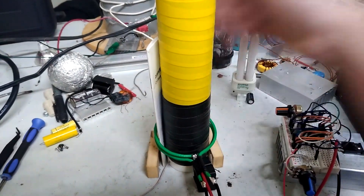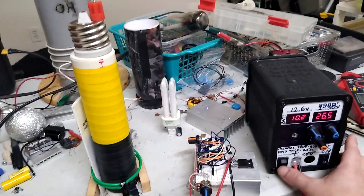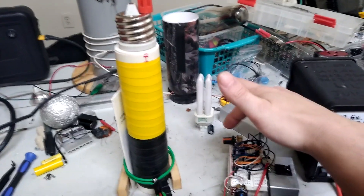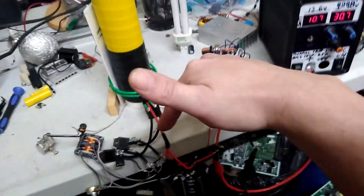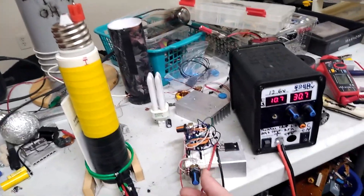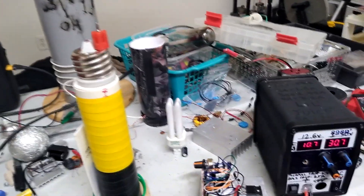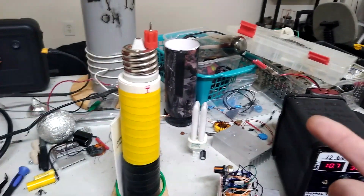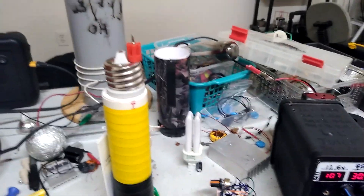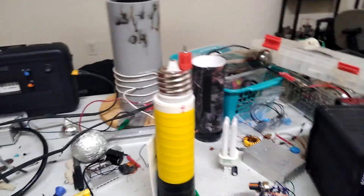Yep, and I got arcing — see the arcing down there, all the way down there, the primary was arcing real bad. So you see there's a pulse train of multiple pulses in duration, and that's because that duty cycle is up a little higher and it's on for longer than the circuit needs to charge and discharge one time. If I bring it down low enough then I can adjust the speed of the pulses up to a certain limit of the frequency I set in the PWM and it'll spark according to that frequency. If I want longer discharges I just up the voltage and I don't really have to get into a crazy high voltage range — I can stay under 50 volts to get pretty good discharges. Since it is being PWM'd at the input now it's just even less power, so it ends up being very low power.